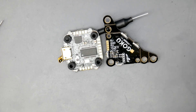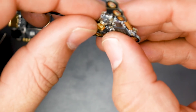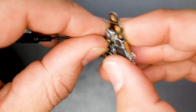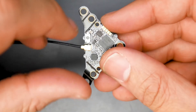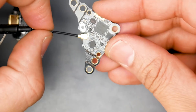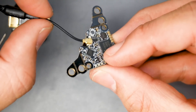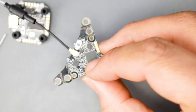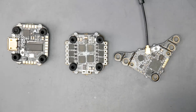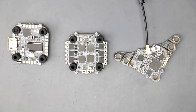You now have a working quadcopter, but there's one critical thing to keep in mind: never power this whole thing up without first installing your antenna, or you may fry or damage your video transmitter, and at the very least you'll lose significant range. Always make sure your antennas are connected before powering on. That's going to conclude it for this video — I really hope you enjoyed it, everything is linked down below, let me know what you think, and I'll see you in the next one. Peace out.